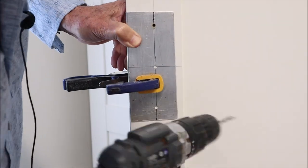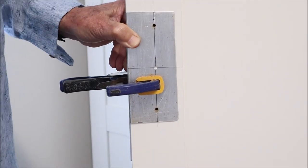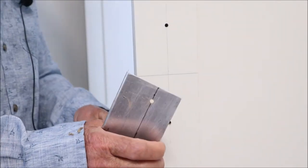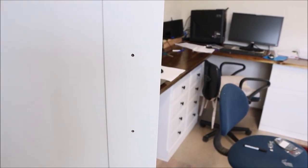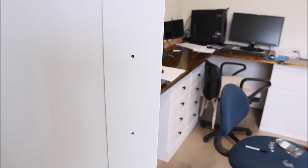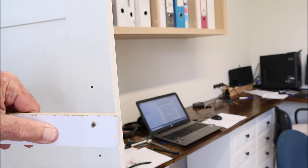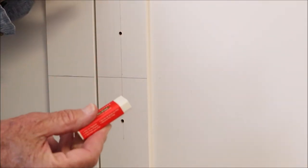Let's do the drilling — runs right through. Remove the clamp and the template, and if you look at the back you can see how neat those exit holes are. I'll show you one that was drilled without the scrap wood at the back — you can see how untidy the exit hole is. Always use that backing piece of wood.